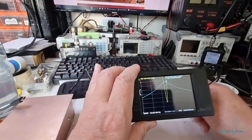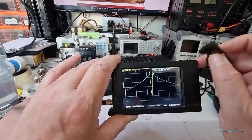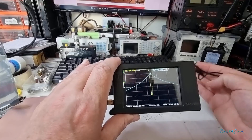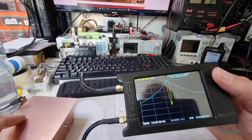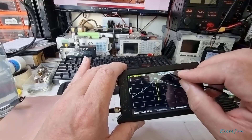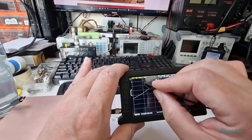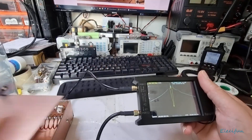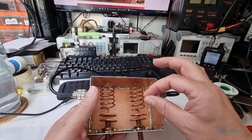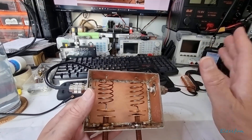What I found — and this had me going for a while — so many adjustments and I couldn't get anywhere. The VSWR was about 30 megahertz out down here. I couldn't get it to line up. No matter what I did, I just couldn't get it to line up. I was playing around, adjusting these phases a little tiny bit in and out, expanding it, making it smaller, all this playing around, and I couldn't get anywhere — that was driving me nuts. I actually got a little bit depressed over it.